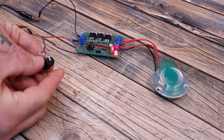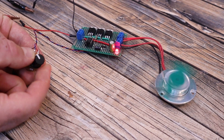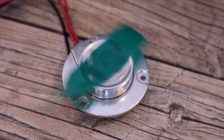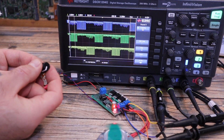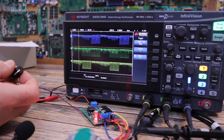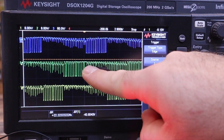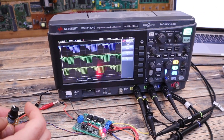Here I also have some slow-motion footage of the rotation. These are the signals from each phase on the oscilloscope — we have 3 phases and when one is pulsating, the other two are off. I've stopped the oscilloscope so you can better see each phase. As you can see, the faster the motor spins, the smaller the delay between the pulses.